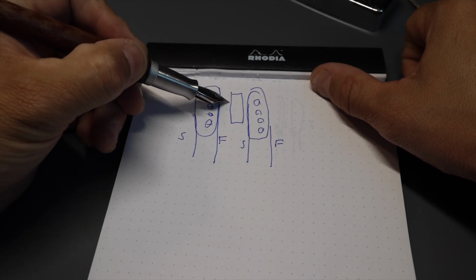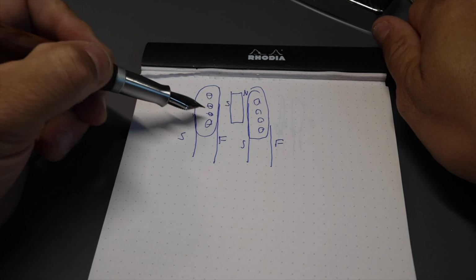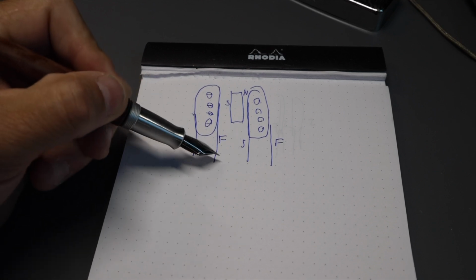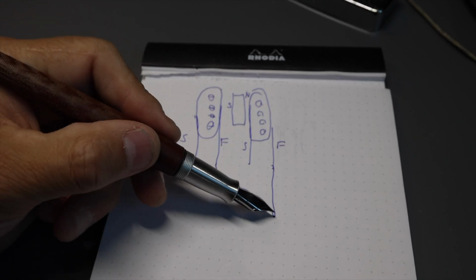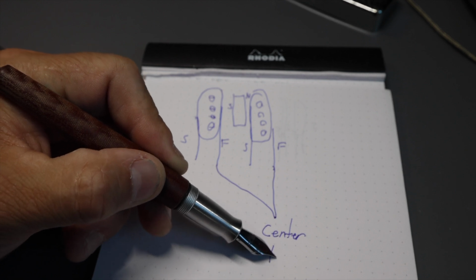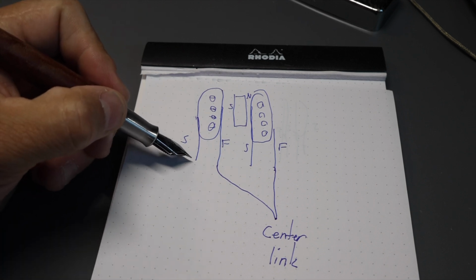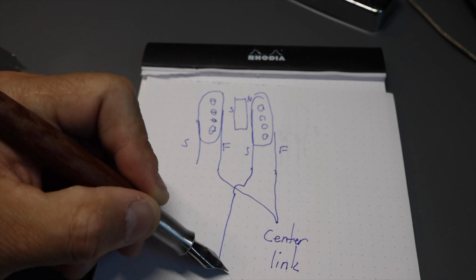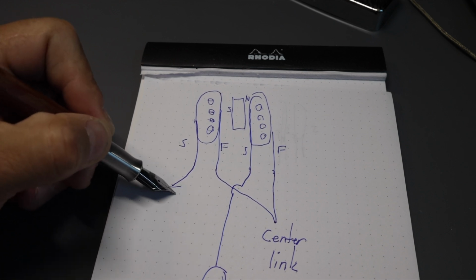The way you wire up a humbucker, because the magnet sits underneath here, okay? On my pickups, the south pole of the magnet is on this edge, and the north pole of the magnet is on this edge. So the coils are wound the same direction, but when you hook them up to the guitar, you're actually hooking up the finish wires together, and that's your center link, okay? So we call this our center link, and that is how the signal gets from one coil to the other, okay? And then one of the starts, on my pickup it's going to be this one right here, is going to go off to the volume pot or the switch or whatever. The start of this is going to go to ground.